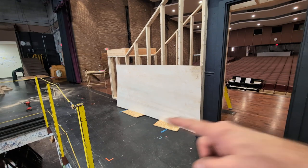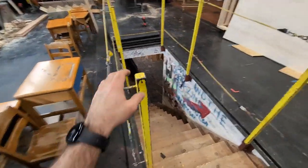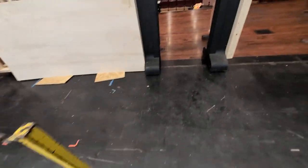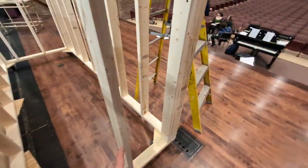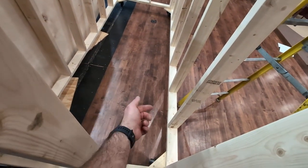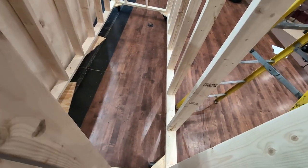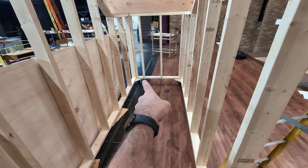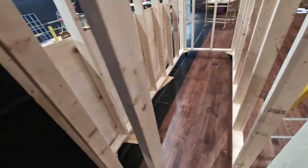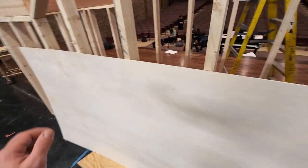I have a few. So I guess we're going to roll this thing over the opening in the trap door. We'll take these posts down. I'll maneuver this thing around and roll over there. And then I'm going to have to put in a cross member and then jump it down. I'll probably go from top to top and then add a piece that just fits inside, so the bottom surface is coplanar with the bottom surface of these. And then I can add probably a square of 3/4 inch plywood, just enough to accommodate the elevation change with the triangles. And then I'll probably put the wheel right on the plywood first and get up and running like that. Then we can come right back here where we were and put this skin on.